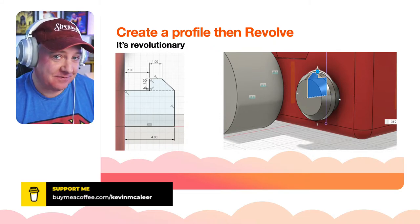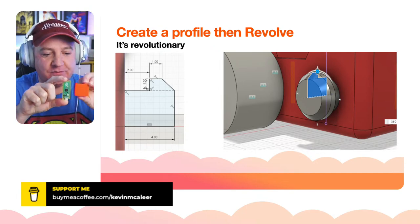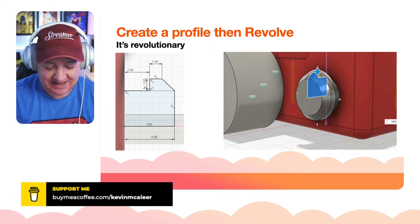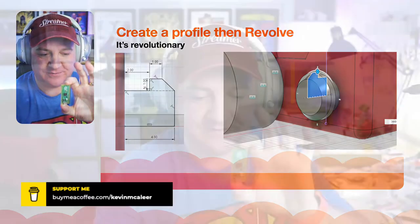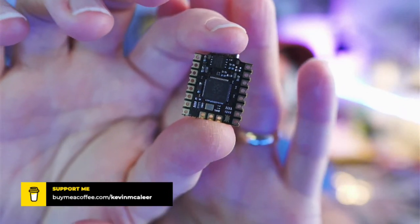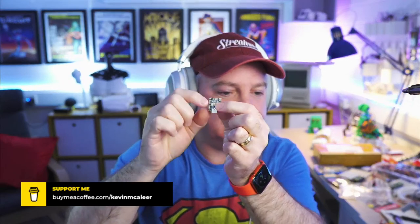So I was thinking, fair enough, the motors are one of the largest components in there. But what about the brain of it? So, we've got our Raspberry Pi Pico. But if I'm going for something this kind of size, that's still too big. Well, Pimoroni this week launched the Tiny. Let me show you this thing because it absolutely is tiny. So this is it compared to, let's go to full screen for a second, this is it compared to the Raspberry Pi Pico. And if I show you full front there, you can see the little Raspberry Pi RP2040 chip right in the center there. It's got a USB-C connector on it. It has two little clicky buttons, and an LED that you can program right in the middle as well. That's the perfect size for our Smars Mini. So that's going to go in there as well.